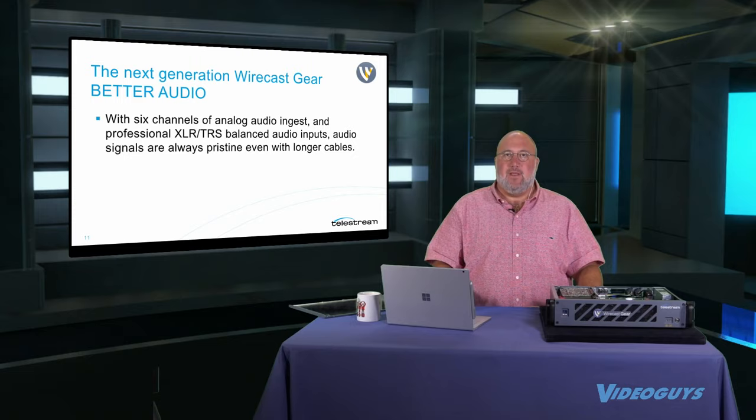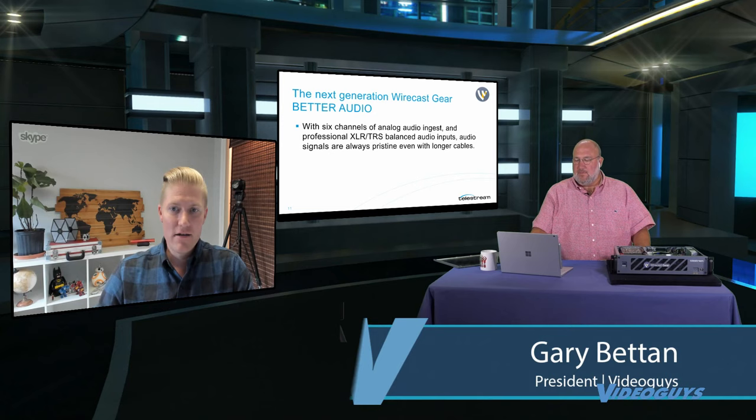Yeah, for sure. So we saw a lot of customers coming to us and saying, okay, we can get our cameras in, great. How do we get our good quality audio in? We're like, well, you get a headphone jack, you get that 3.5 millimeter input. And we're like, no, that's not going to work for a lot of customers. So we found ourselves having to push a lot of audio capture cards. And so we said, no, we need something better than that. And we built in the XLR TRS audio capture card. So you can take a stereo pair in, left and right channel, TRS or XLR. But you still have the USB options, so you can connect a professional sound capture card too. So we have the capability of doing both now.